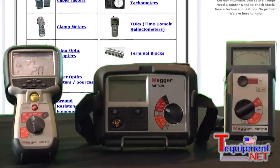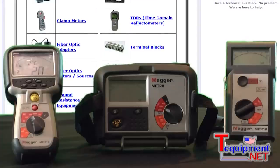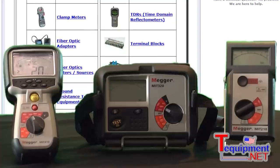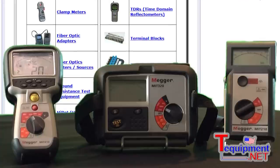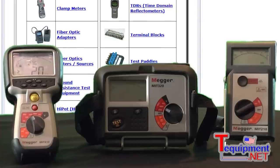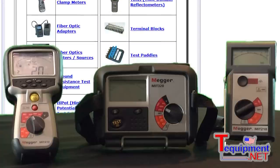This is probably the most significant product we have in the 1000-volt insulation testers and below. It was really designed with multimeter functions like the others. You could do some high and low limits if you'd like. As far as testing is concerned, the insulation resistance, depending on the product you select, could go up to 200,000 megaohms. When you're dealing with something that large, you're able to capture the value as the resistance starts to drop, and you know there's a problem either in a motor or a cable and you're able to analyze the situation.